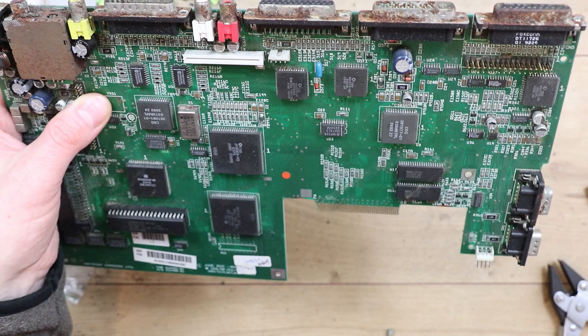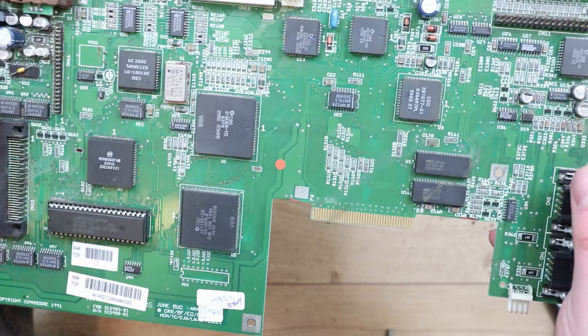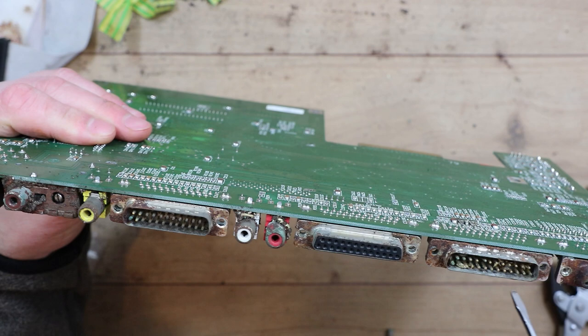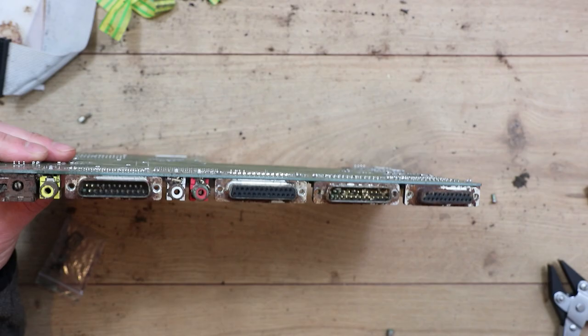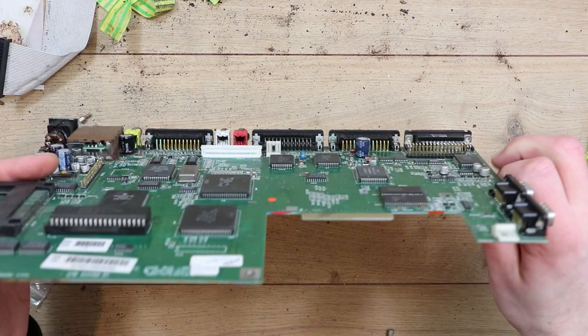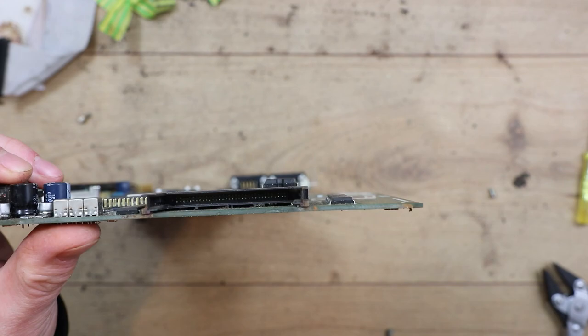With respect to the actual keyboard, I don't think that's screwed in — there are a couple of places where it's attached. I've just had a sneezing fit because of all the dust. This keyboard is looking a little bit rusted up. It does appear to be attached in a couple of places to the casing — I think it's just a clip, but it's very well clipped in. It's quite rusted up on this steel plate here. This could be cleaned up — sanded, cleaned, and probably given a coat of black spray paint. Some of the keys I tried were sticking, and I don't know what state any membrane is going to be in.